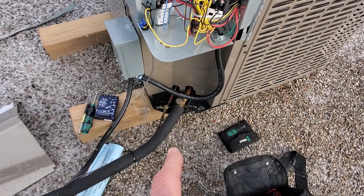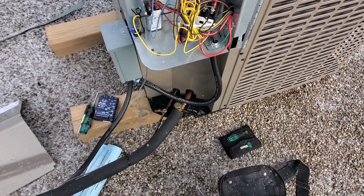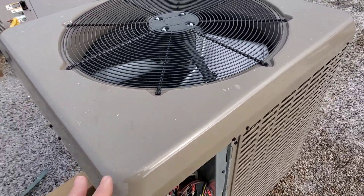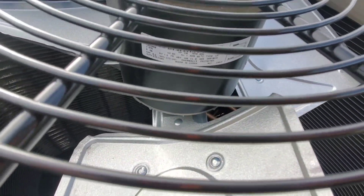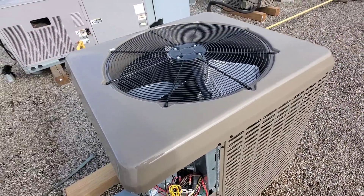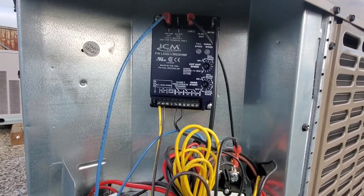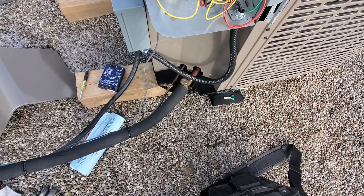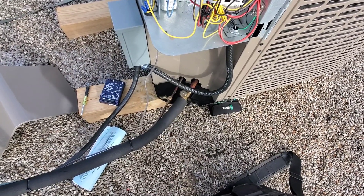I want to hook up my gauges to see what pressures we're getting, because if we don't check that and we're dropping below a certain pressure on the suction side, we can start freezing up — like what originally happened to this unit. Looking at this motor, it doesn't indicate whether it's sleeve or ball bearing, but I called York Tech Support and they confirmed it is a ball bearing style motor. So we'll leave it in the minimum position ball bearing setting, and now I'm going to stick my gauges on and check pressures. We don't want to get below maybe 35°F saturation on the suction side.